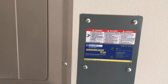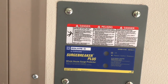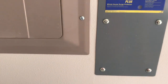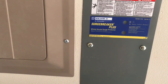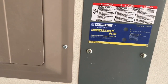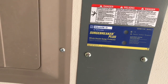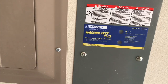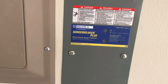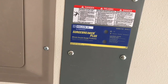I wanted to show you another feature added to the house — a whole house surge protector. You can see two little green lights, both are on. This protects us from large voltage spikes and lightning strikes, not only from the power system but also through your internet connection from your ISP. These are not that expensive — about $150 from Home Depot. If it saves you one or two trips to a repairman because an AC compressor got blown out by a lightning strike, it has served its purpose.